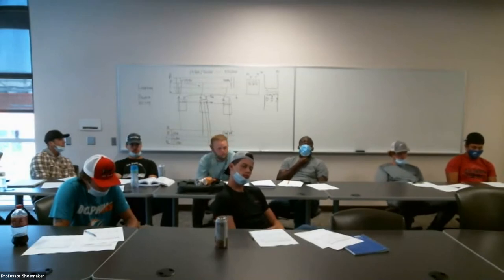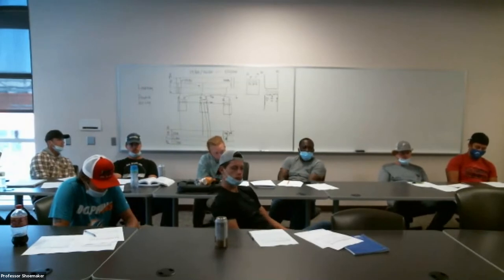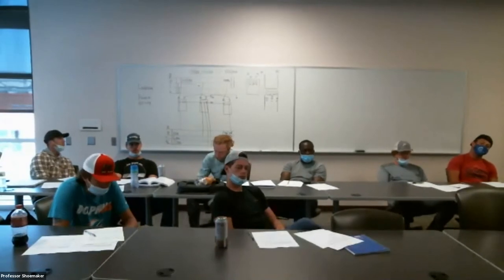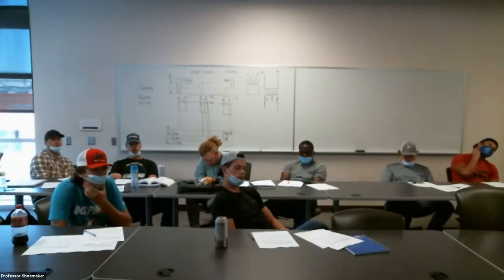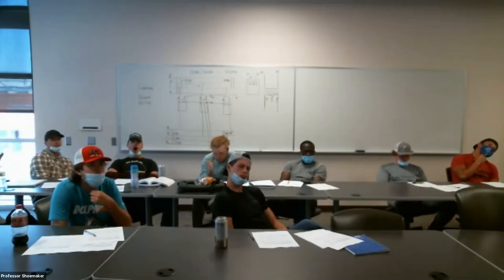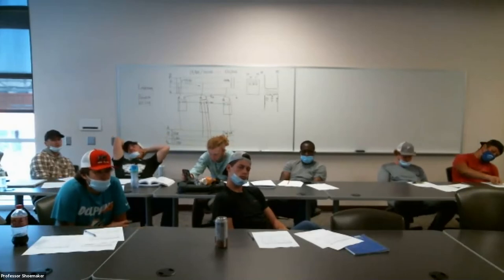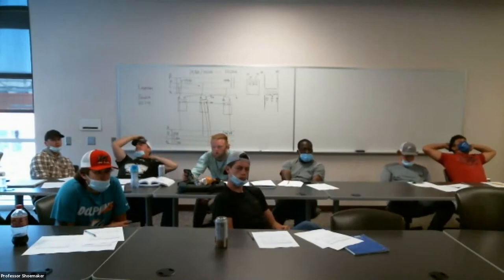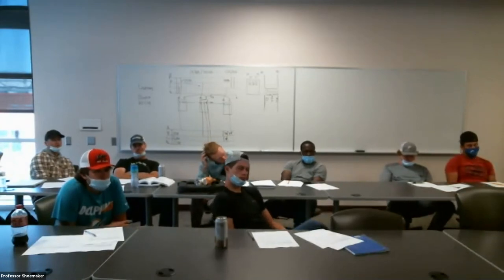Now, let's bounce back to the quiz we had yesterday. How do I color my phases A, B, C? Red, white, blue. This is an industry standard, and if you're going to try to make it as simple as possible, I'm going to put A, B, C. That way, when I hook up my rotation meter, which we'll show you here in a little bit, I'm going to go by color. Red, white, blue. There you go. We'll tell you all about the rotation meter here in a second.